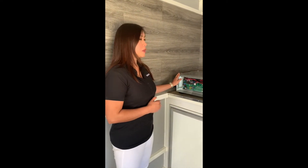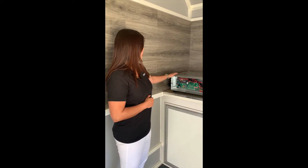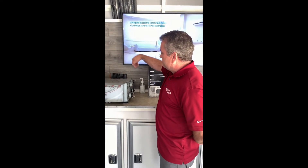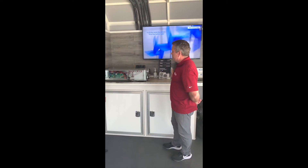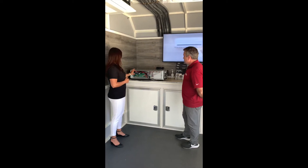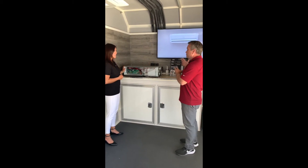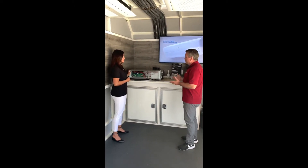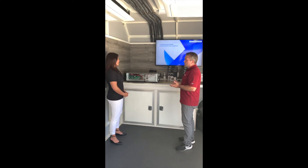I can use this system with all of the fan coils you've shown us. I see some piping going out through the side — does that connect to the condensing unit? We've got three pipes coming into the MCU box, and then out through the back going to each air handler. This is a four-port, so we're able to go to four air handlers, and we can add more MCUs to go to more air handlers. I see all the buttons and lights flashing — does that mean it's working? It's actually a working unit — single phase. We have it set up so we can plug into 110 power with an inverter, so we can take it anywhere, run it on house power, or use a generator for remote locations.